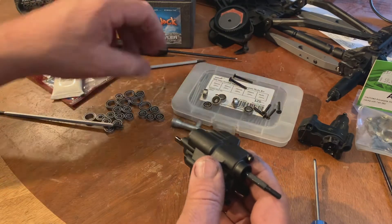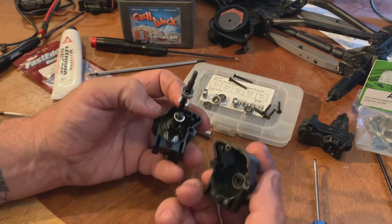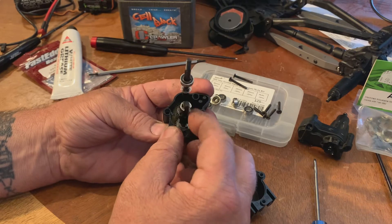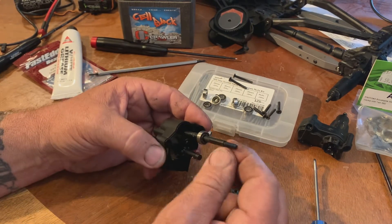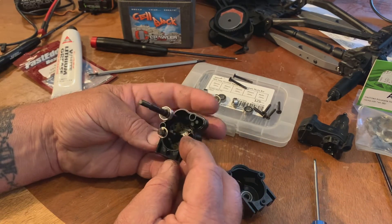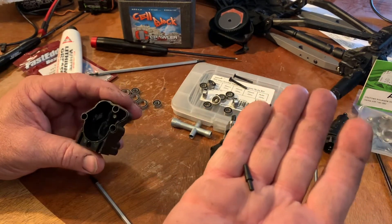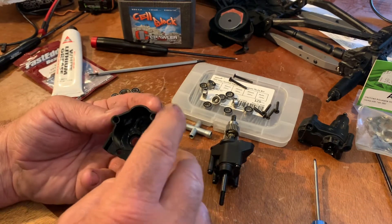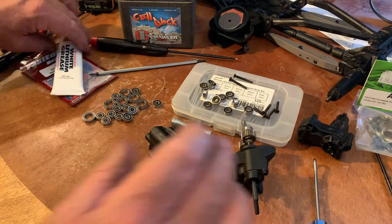Let's see what kind of condition the transmission is in — actually it looks pretty good in there. I did think about putting a two-speed transmission in this because I have the kit, but I just don't see myself doing that; it's kind of a frivolous deal. While you're doing this you may find this little thing has fallen out of your transmission — that's the porthole block. It goes right in there because the two-speed transmission shifter linkage goes through there. Since we're not using it, make sure you put the plug back in. Then a little white lithium grease on the gears.